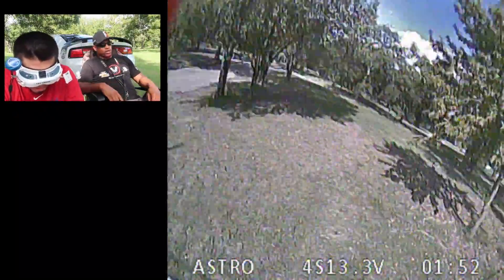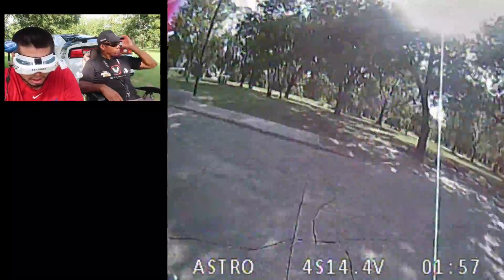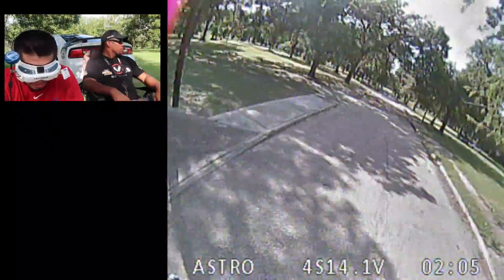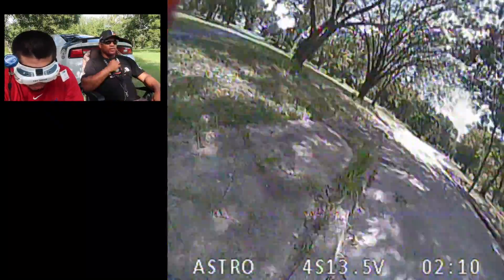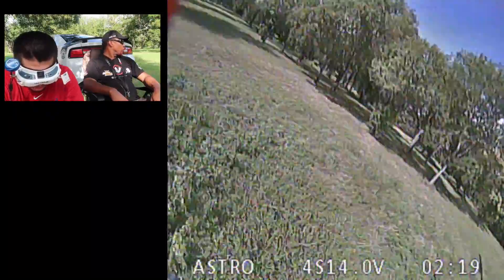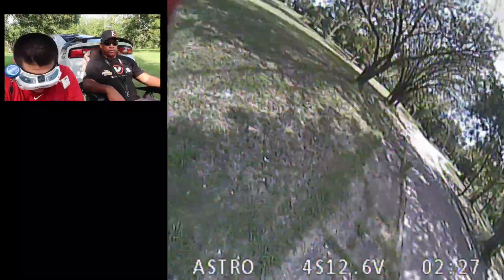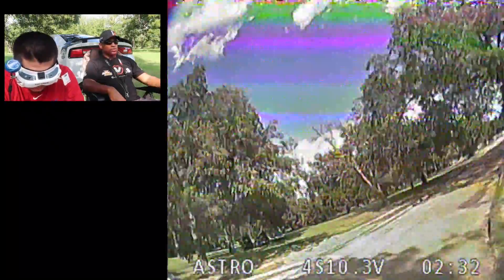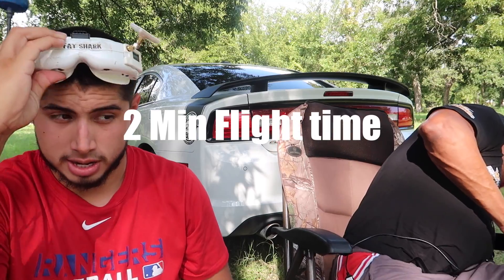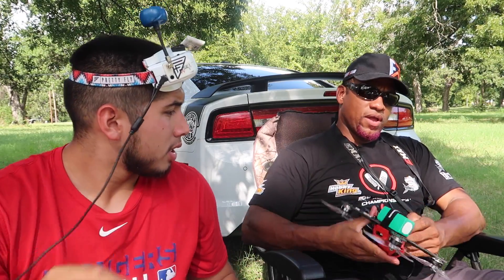I'm looking at my voltage. Usually with fresh packs you don't get too much sag. How long have I been flying? A minute and 24 seconds — not bad, and that's the 1500 by the way, the smaller one. They're actually very small, smaller than our graphene 1500s, that's for sure. You haven't really done a real long throttle pull on it. I'm at like 10 volts — wow, it literally just kind of dropped, like close to like a graphene. It was at like 13.9 to 14 and then just dropped to like 10. Let's go ahead and check it — is it puffed? It's hot as hell, but it didn't puff. So it didn't puff, so far so good.